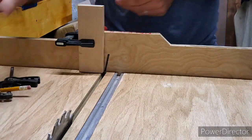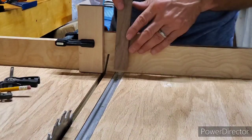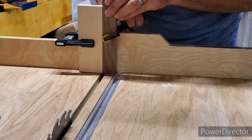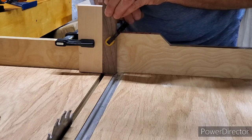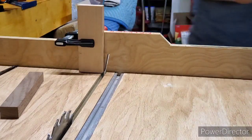Now what we're going to do is, when we have our three-inch block, we're going to hold it here, clamp it, make our cut, flip it over, clamp it again, make our cut, turn it upside down, make our cut, rotate it, make our cut. And that's it — that's all there is to making this bow tie on the table saw sled.